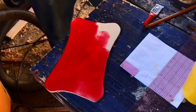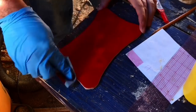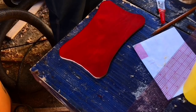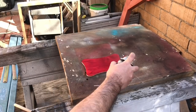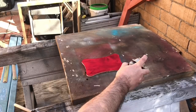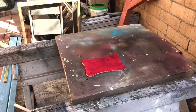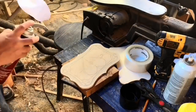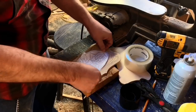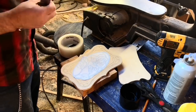Then it was time to work on the decorative part of the box. The first thing I did was dye the top of the lower lid red with leather dye and then sprayed that with polyurethane. It's important to use poly because normally I would use shellac, but this red bleeds when I do that. So instead I use poly, and if I do a light first coat to seal in the color, it doesn't bleed.